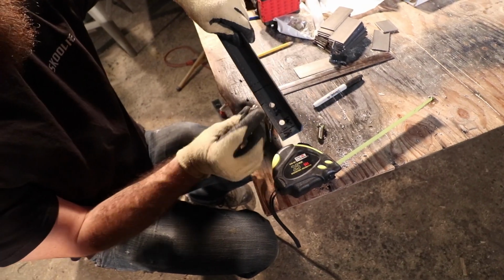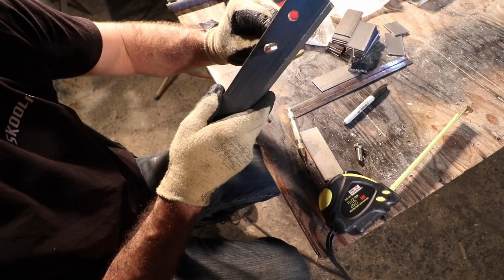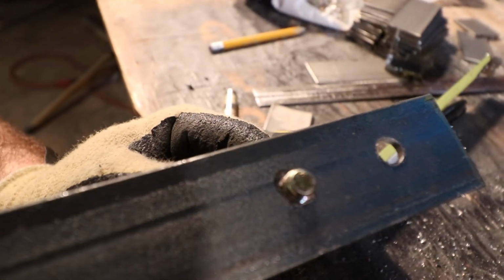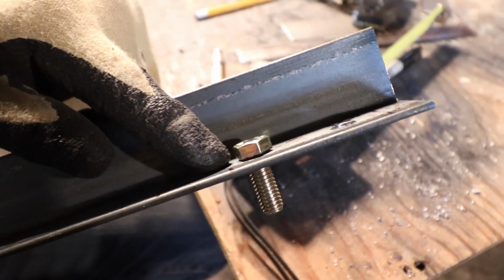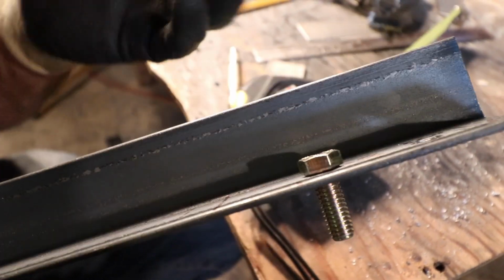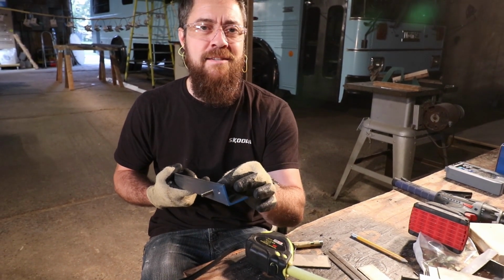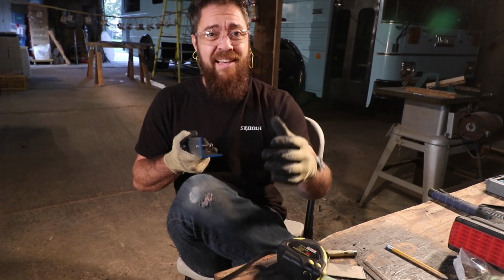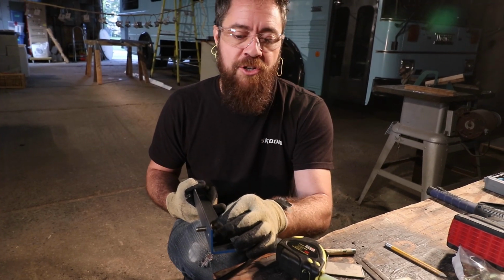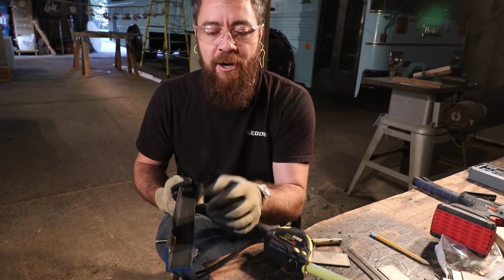To show the 3/8-inch bolt slides in with virtually maybe a 32nd of an inch in play. No play. It's super tight tolerances. And that's why I'm not using a washer here, because it's kind of redundant to have a washer on something like this, versus if this hole was too large and there was a lot of play, like an 1/8 of an inch, you might want a washer to spread it out, but that's not really gonna help in this scenario.